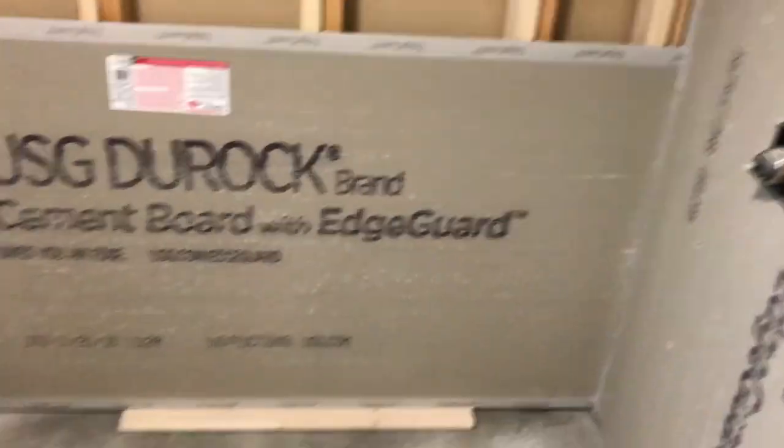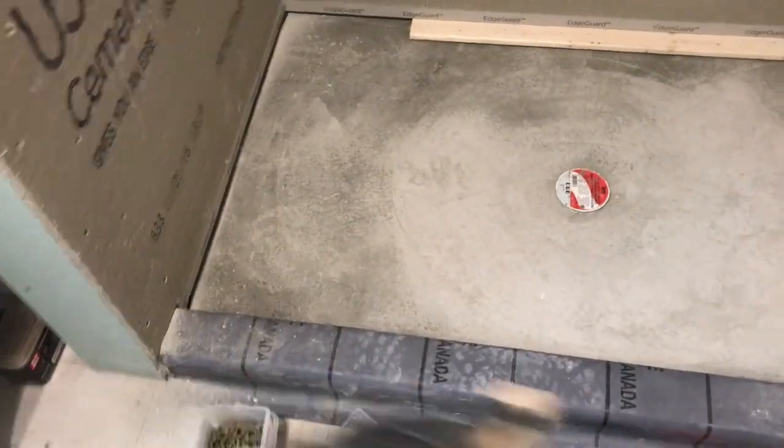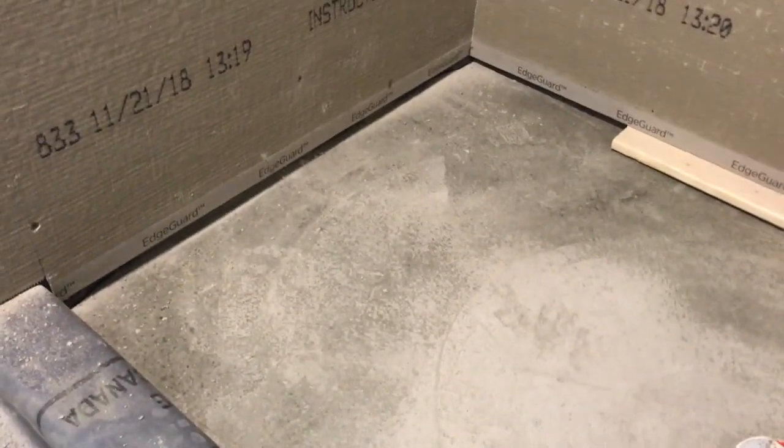That's my little trick on how to deal with those inside corners. I'm basically going to do the same thing in these corners — I've got to get that fold squeezed down and that fold squeezed out as much as I can. I leave a little gap right underneath there because we're doing our floor first. When we do our floor, I literally just start at the center and work my way out. My tile just goes right under there, and when your wall tile comes down it's going to cover the floor tile — it'll be a perfect line going right across.